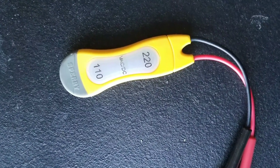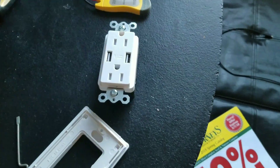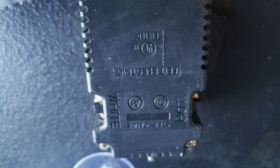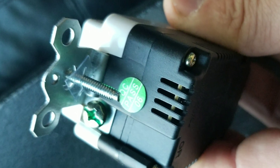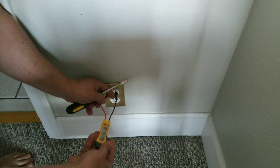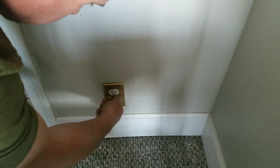The first thing you're going to have to do before you even start is pull these two face plates apart — you'll find out why later. Make note of the back of the plug: it says white and hot. So you'll have wires coming out — they'll be white wires and black wires most likely, and a green ground on the bottom of the plug. Turn off your main, check your power, and if there's no power, go ahead and unscrew your face plate.